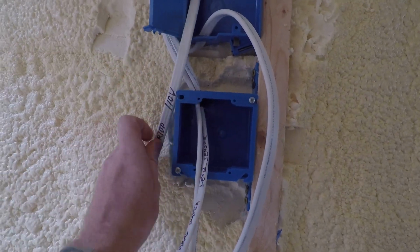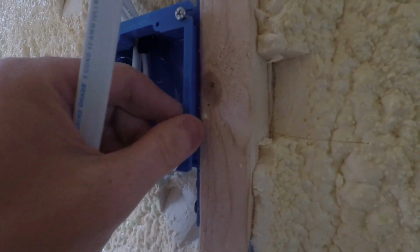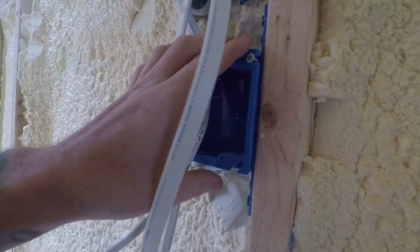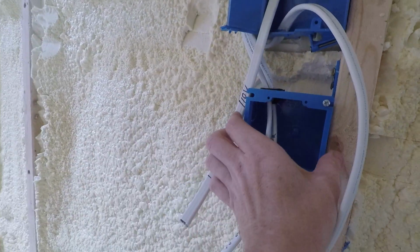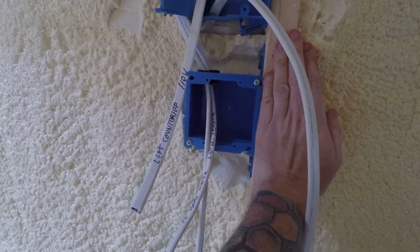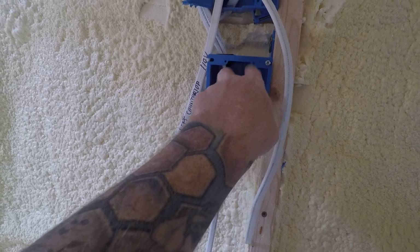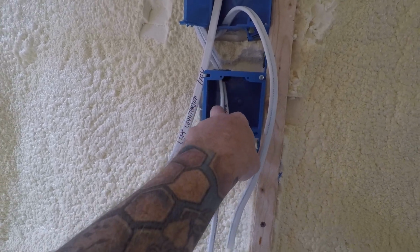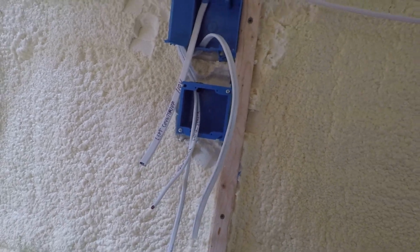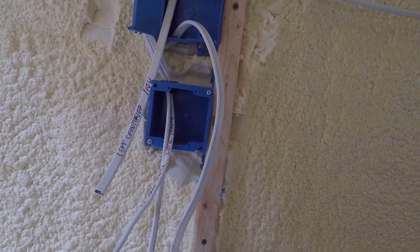this one. It's a 2-gang. That one gets installed flush with the framing, and then you have this mud ring in the front that sticks it out, so that when you add the wall, it sits flush. And this one will be for the DC switches. Two switches here, and I have two in the front for the outside and inside lights.